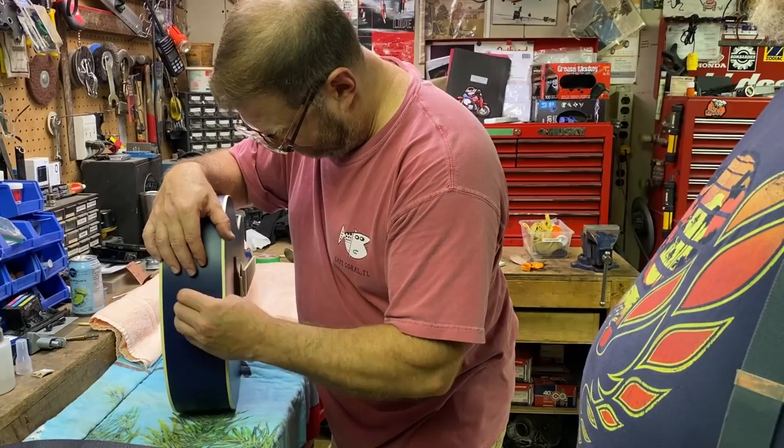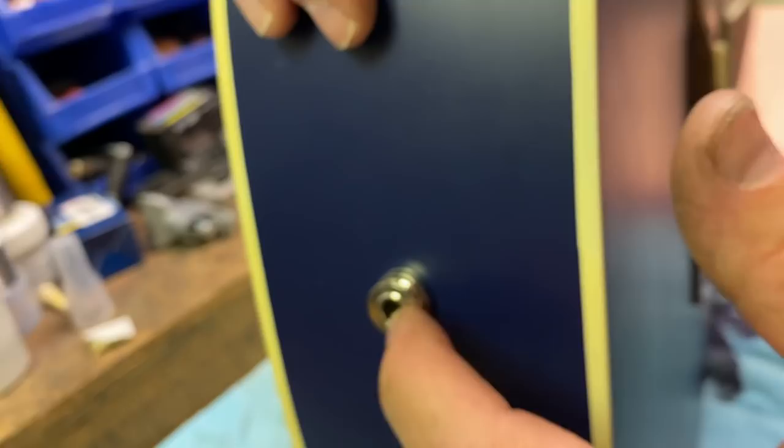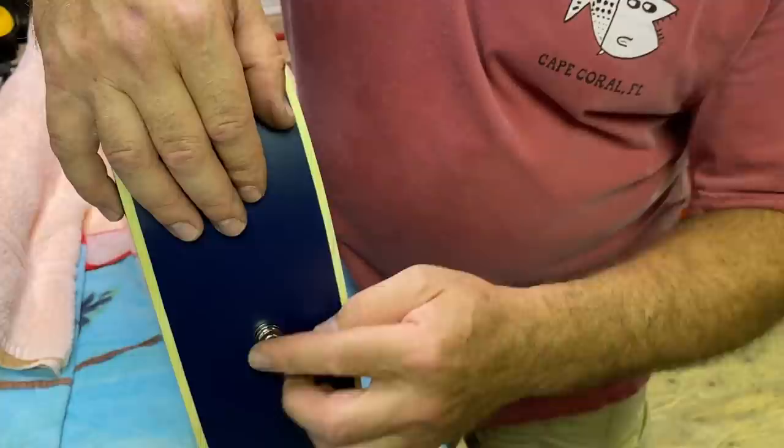And then we can test fit that bit, because this is important too. If you don't make sure that the end of the barrel comes out, the plug can't go all the way in. I've seen that happen to people on stage, fiddling with their gear all the time. It's because they've got this way inside and your jack can't bottom out on the spring. So I like to set it a little tiny bit proud like that, just so you're sure.